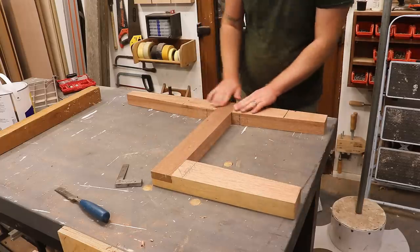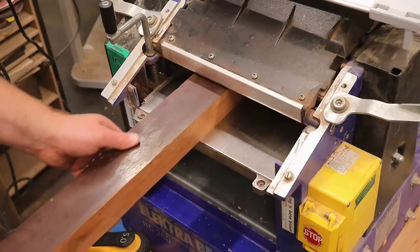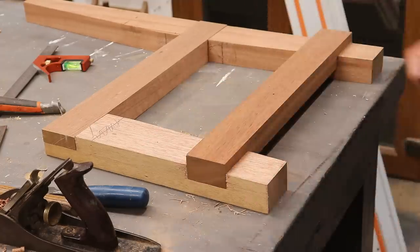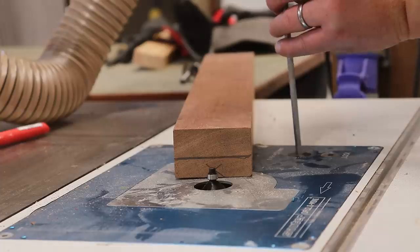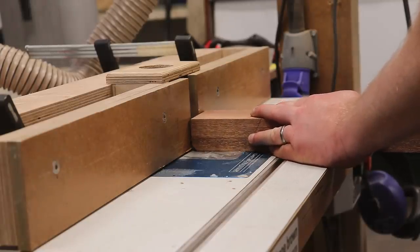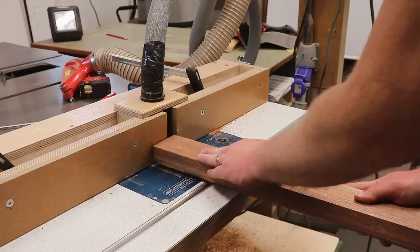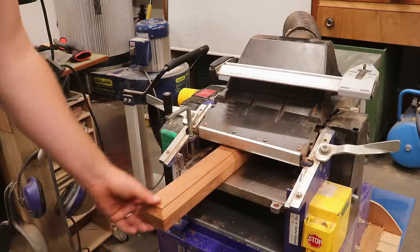I'm going to need some more wood for the rails at the bottom of the leg frames. For these rails rather than cut half laps I decided I would just house them into the legs halfway but keep the rails whole, as these rails will sit on the inside of the bench. I'm going to add a bevel detail to the inside face of the rails using a bevel bit in the router table, making the cut in about three passes to get the depth I want. I raise the bit each time until I have a nice chunky bevel, then a couple of passes through the thicknesser to get rid of that ridge at the top and it was ready to fit.